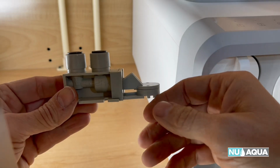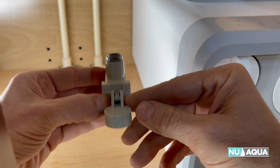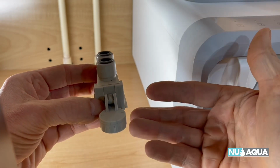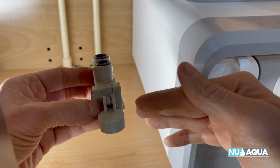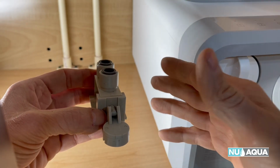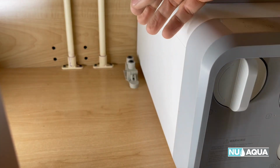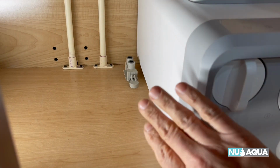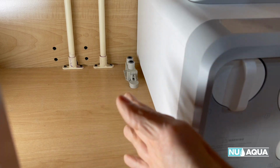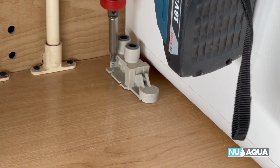Let's install our water stop leak valve. You're going to want to place the disc tray towards you. So in case it ever gets triggered, you can refill it and reset the system after your cleanup, and you'll be good to go. Let's place it on the floor of your cabinet, right next to your unit. That way it has easy access and it's mostly out of the way from anything else in your cabinet. Takes just 4 screws to fasten it down.